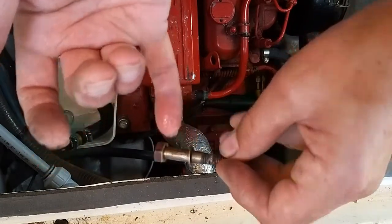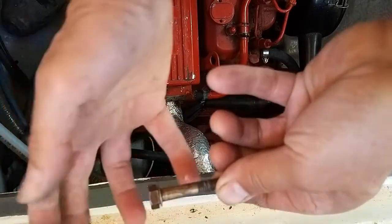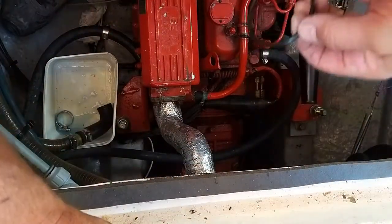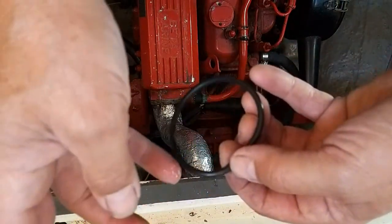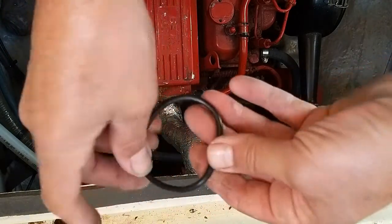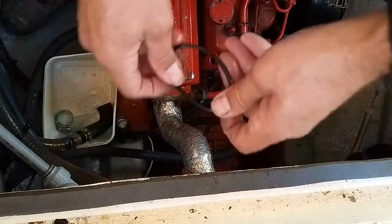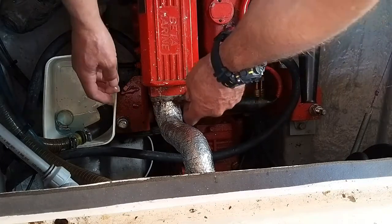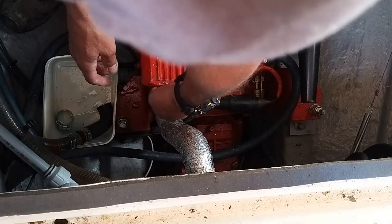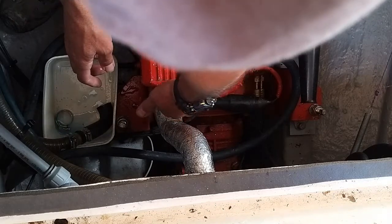Now I just get a very small amount of silicone grease and run it around here, then slide the washer back and put a bit more around that side — that's ready to go. Again just the slightest amount of silicone grease on the large o-ring, hardly anything, just the very slightest coating. Push the o-ring in just so that it's seated inside the face and against the heat exchanger.